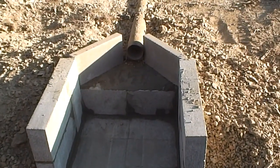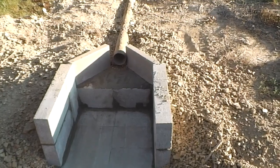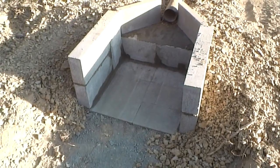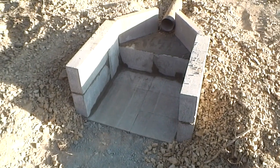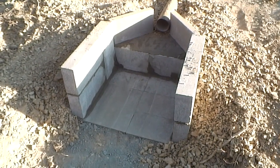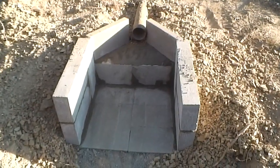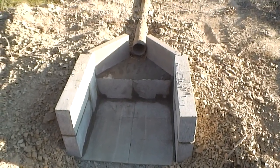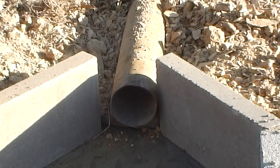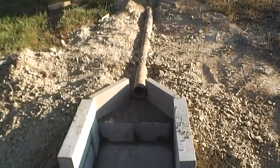Not counting the little shelf up there to funnel the smoke. There will be a steel plate that sits on top as the lid, and I'll probably weld a hinge to that steel plate to have a door I can close in the front. I'll have a damper — probably salvaged off an old grill — stuck in the front door so I can control the amount of air going to my fire and the amount of smoke going to the smokehouse. The firebox is all set and mortared in, the pipe is laid. I'm going to get some more mortar and fill in around the pipe so no smoke can escape before I bury the whole thing.